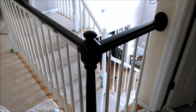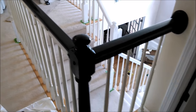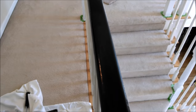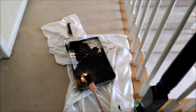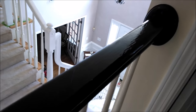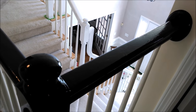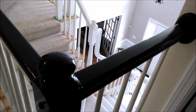I started painting with the black semi-gloss oil. I rolled the top surfaces and then painted the other surfaces with the brush, but in the end I think the brush is really going to be the way to go. Here's a post that I've done — the brush marks show a little bit, but they should recede. I would recommend using a fine, very good brush.